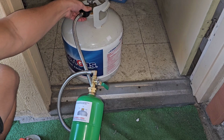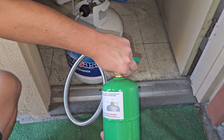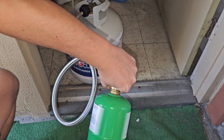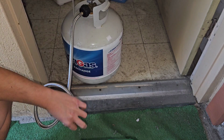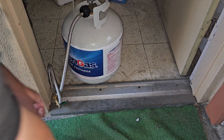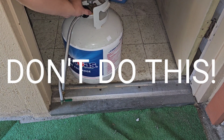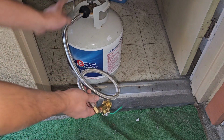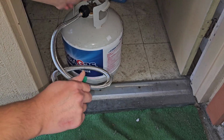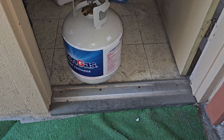Oh. Jeez. Okay, so you saw the propane coming out. So we have to quickly take this off because it's pushing the thing to release it. Okay. I released a bunch of propane through taking this off. So you need to make sure to take this off first. Ah, high pressured. Okay, so after, I guess you can open this to let out any excess. And then we can undo this. There we go. That's the proper order.